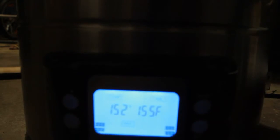I have it set at 155°F to simulate a mash. It's at 152°F right now and it's on. What happened was I had the boiling water and I set the mash temperature to 155°F, brought the temperature down to simulate a mash. I had like 200°F water, set the temperature at 155°F, the elements turned off like they should have. Then I added cold water and brought it down — it didn't turn back on until it got to 150°F and then it kicked back on.